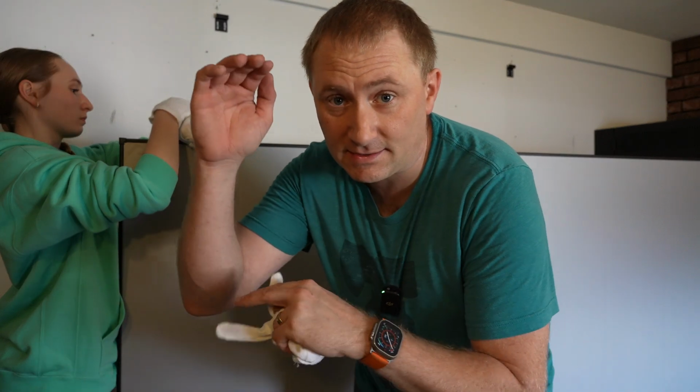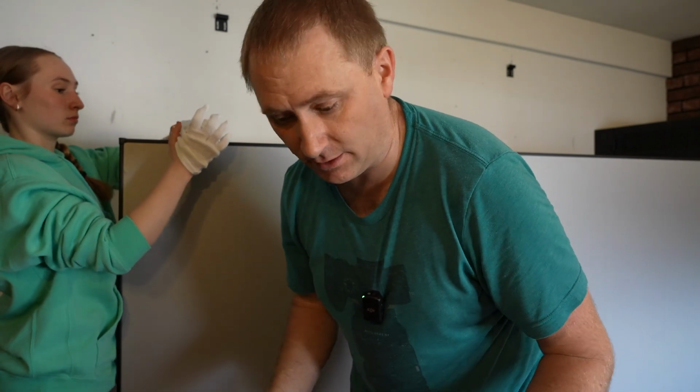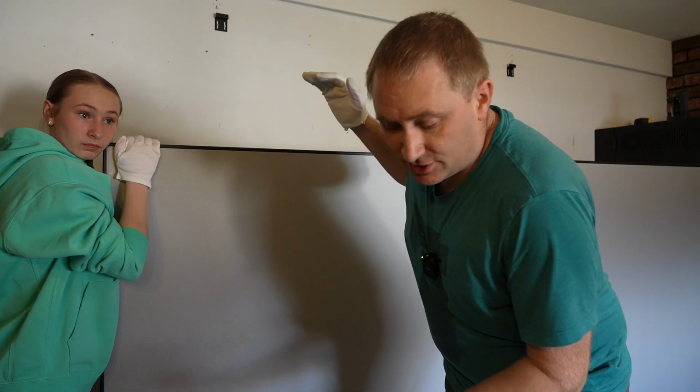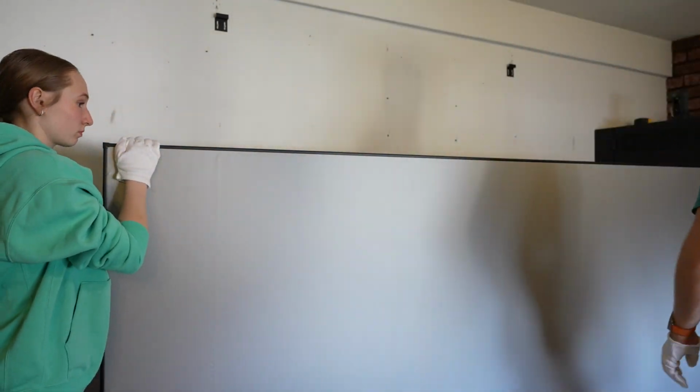So I measured inside to inside. I didn't think about the hook going up. I got to actually be a further inch down, actually 48 1/8, I believe. So I'm just going to adjust that real quick. Okay, so now we are 48 1/4 from the top edge to the bottom edge of the sliding bracket, 1 1/8 down further. Should be good now.